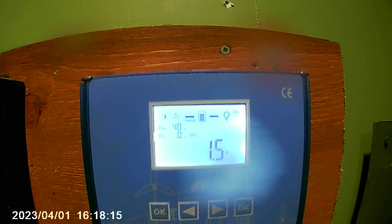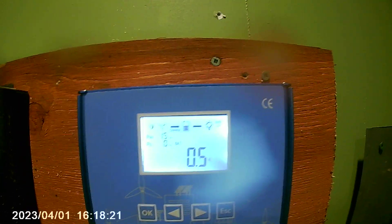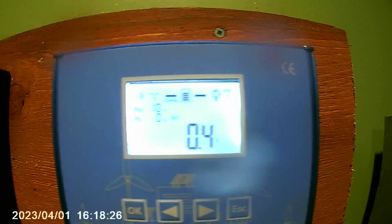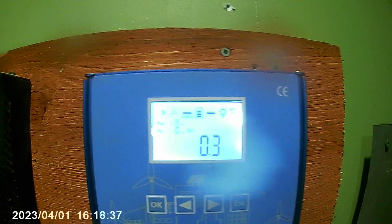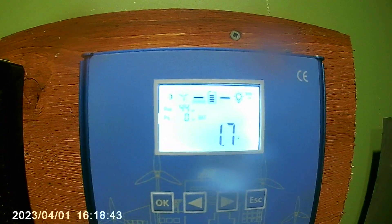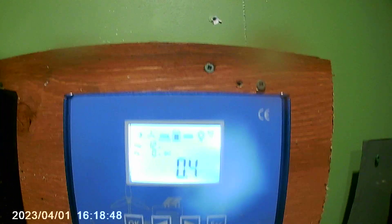That makes for another question, but I think it's going to be an ideal way to test this further with the i700 with the 5-blade theory, because it is a 5-blade 90 cm blade with a 5-blade hub. So I'm thinking I might take the 3 blades off — those are 107 cm — and swap them out with the i2000 blades. Just a thought, but I think the 5 blades on the 90 cm would be a better fit, and for the smaller turbine it's definitely going to collect on the higher winds.